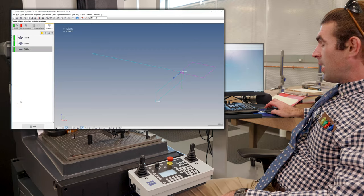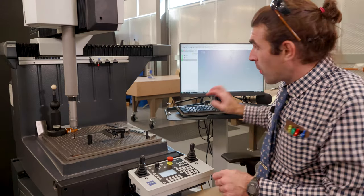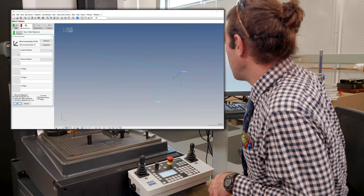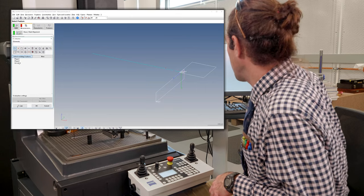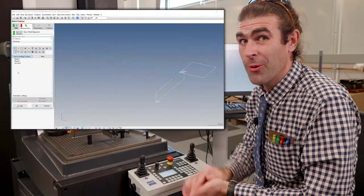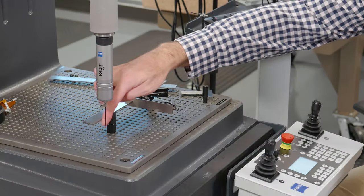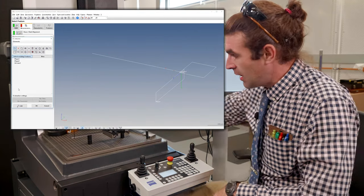Now I'll come down to the blade. This is one of those things where you have to lean over and make sure you're right in the middle of the blade. Once I'm sure, I'll just drive right on, straight out, and take three points. When doing a 2D line, make sure you don't move the Z up or down — drop straight in again, straight back out. The strategy will be OK for this one because I do want it to scan.